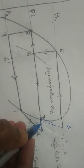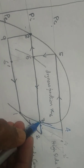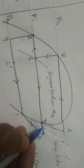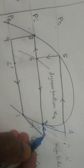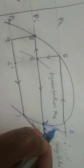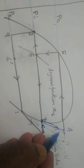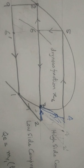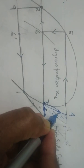Instead of state 2 becoming state 3, it has now become state 7. This extra amount — from state 3 to state 7 — is the excess amount of cooling achieved. This line shows the extra cooling effect. Earlier, cooling was achieved by mixing; now the vapor is coming all the way to point 7. From state 7, compression takes place — not from state 3 — so there is further decrease of compression work at stage number 2.